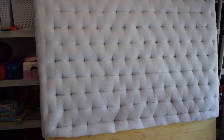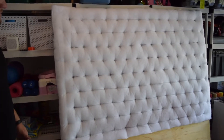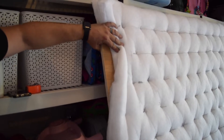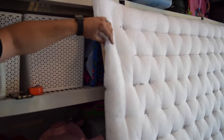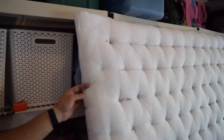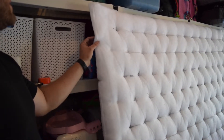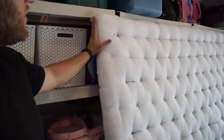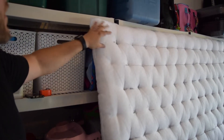After we took off the old black fabric, this is what it looks like underneath. We have five-eighths-inch higher-grade plywood, so it's not going to come apart and it lasts forever. For the padding underneath, we used batting rather than foam, which is much cheaper. We just doubled it up, going back and forth about five times. You always want to overshoot the material a little bit so it wraps around the edges and gives you a fluffy edge.